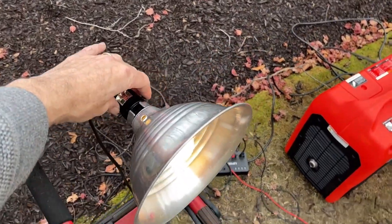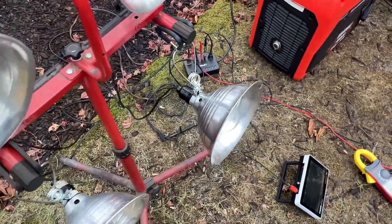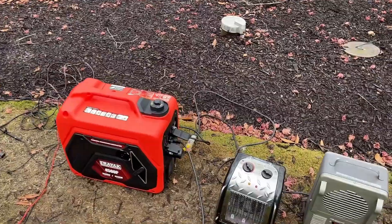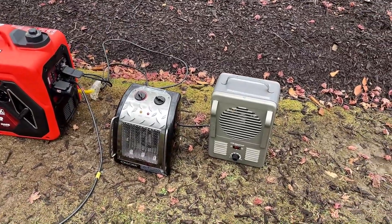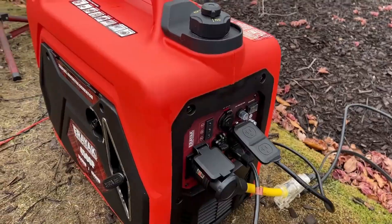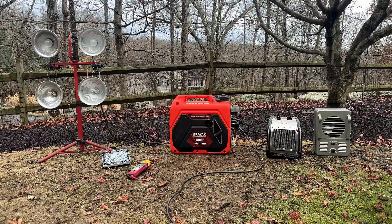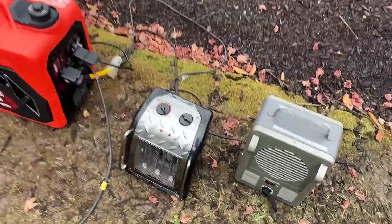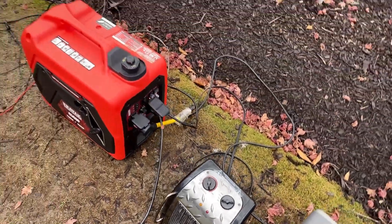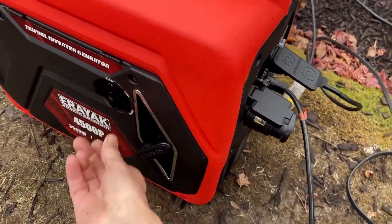Turning the bottom one on to go back to 3,400 watts — and that was it. The inverter module just tripped. You can tell the engine is now back down to an idle, and the heaters are coming to a stop. I'm going to give this a second and let the engine cool a bit, then restart the machine to get the power back on. We'll take the loads off so that when we restart we're not stressing out the machine — it would likely stall if started with a load on.